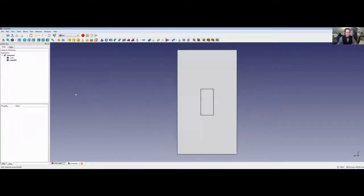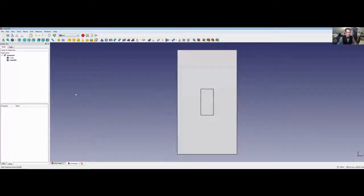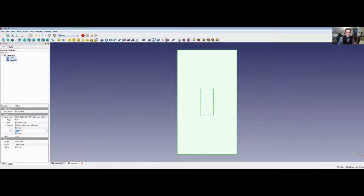If we change views, you can see this thing, and it's actually completely penetrating the other object — that's how that's going to work. You can see it from the various sides, even diagonally. So, you click the first object, then control-click the second object so now they're both selected. Use this cut tool, and boop — now you've got a hole. It creates a new object called a cut, which you can pick apart and modify if you need to. But we don't need to because that looks good.